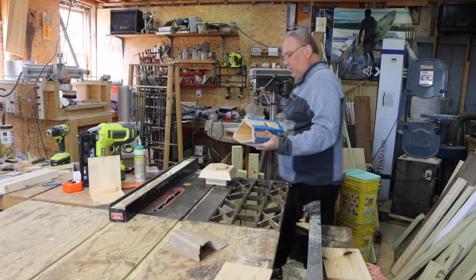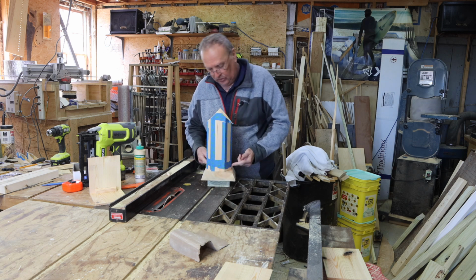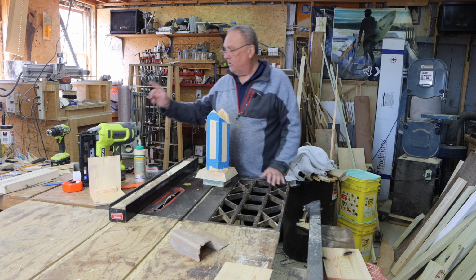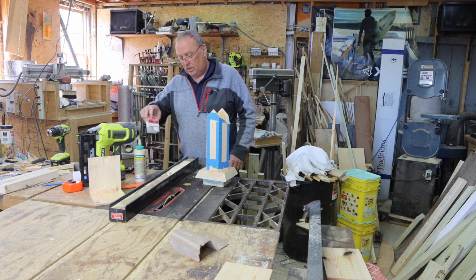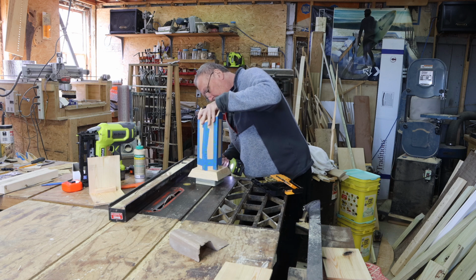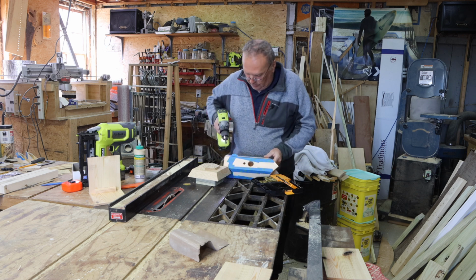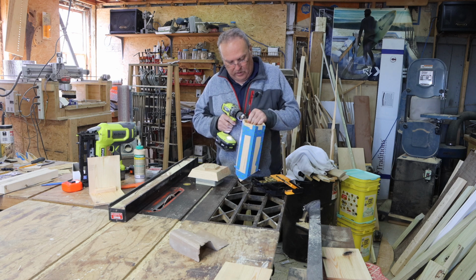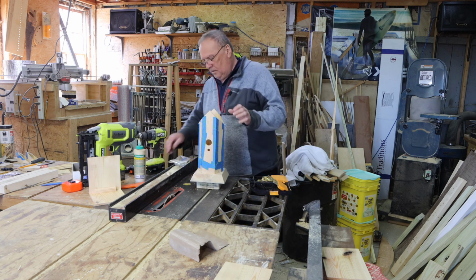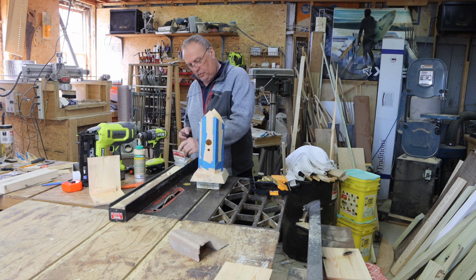So what I want to do right now is start figuring out the final placement of the fasteners. The 3 fasteners I want to put down here, and drill a little hole. And use those sheet metal screws to anchor it correctly to the bottom. And a little chamfer bit so that I can put a little chamfer, and I'm not going to press on it because I don't want the side to unglue. I'm using number 6, 3/4 inch screws here.